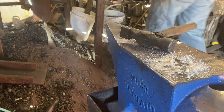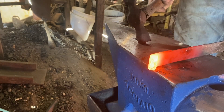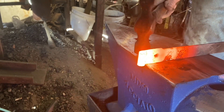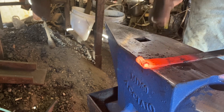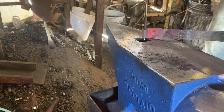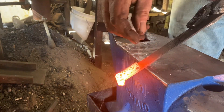If you haven't figured it out yet, I'm making a set of hinges. It's really light stuff — just get light quick blows of the hammer to set that forge weld. Give it another pass at welding heat, make sure it's stuck. This is pretty cruddy old steel. It's welded, but I've been much happier with a piece of new eighth-inch bar stock. But it'll be okay. Drift our hole back out. That drift is just a piece of quarter-inch round stock that I've ground down on both ends, and that's just to size the hole.